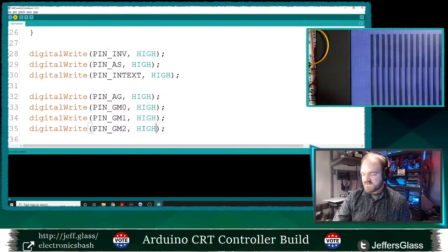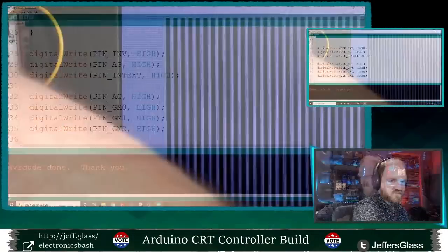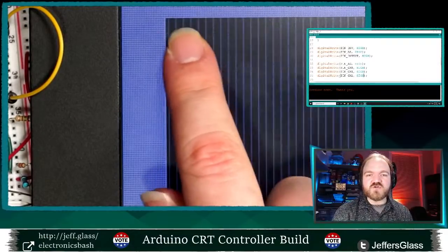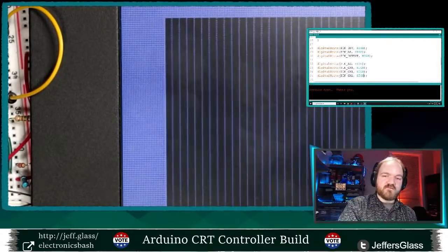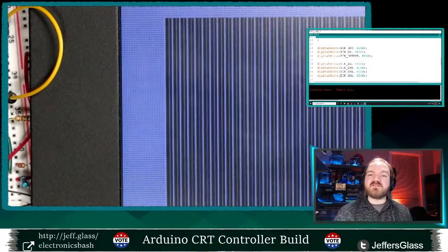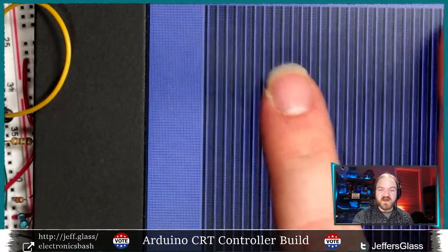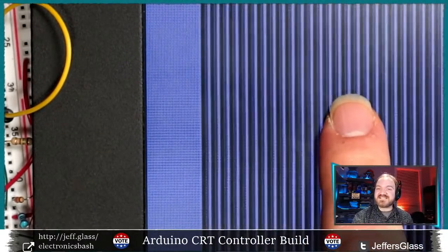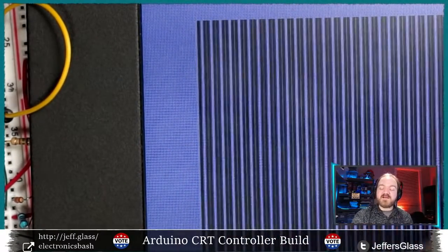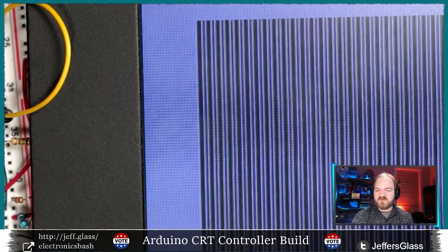And that really is the thrust of what this chip is allowing you to do, when you're building one of these microcomputers, to make trade-offs between how much RAM you're using to store the state of the image on the screen versus the resolution and the color data of what you're displaying. So if you only have 512 bytes to spare, you can still have a text display or very limited graphics. If you can spare, I think this mode uses 6 kilobytes, you can have a fairly high, for the standards of the time, resolution display. You just might be eating up a fairly significant chunk of the RAM in your microcomputer to do it.